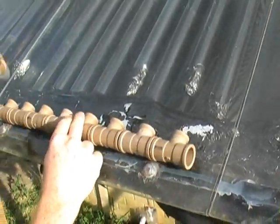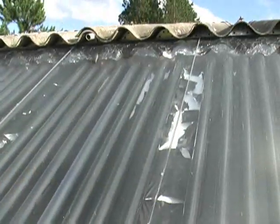What I did to make the hot water heater: I stuck T-fittings together with small pipes in the middle. So I have a row of T's here and a row of T's up there. Then, inside this glass — you can see here — there is a fluorescent light bulb tube. I cleaned out all of the dust inside so that it became a clear long piece of glass, and I punctured both ends so that I could get a 20 millimeter or half-inch pipe to go inside of it. I have about 32 of these pipes. The square footage of the collector is about 27 to 28 square feet, or 2.5 square meters.